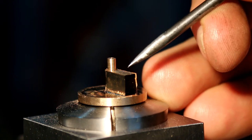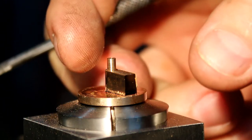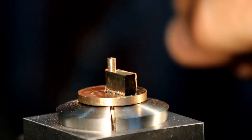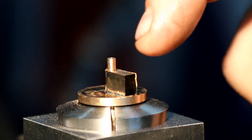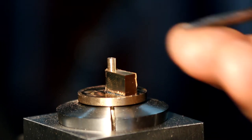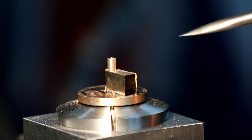By parallel, it could very well be a hardened and ground dowel pin, anything that's narrower than this, basically in my tiny little toolmaker's vise. The entire vise is this long, so I'll grip that and flat against this face, and I'll fly cut that back face to the finished thickness. Then I'll turn it around and I'll grip it between that face and the other face, and I'll put the counterbore that goes in the back here, basically to accept either a standoff to hold the entire engine in the boiler, or there'll be a copper feed line running in.